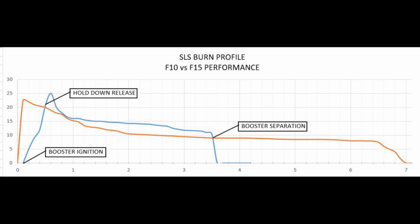To do this, you have to time everything correctly — all of that timing is really critical. You have to have the boosters triggered and the core triggered so that they don't overshadow each other. The core has to always underperform the booster for the booster to remain intact with the core. As soon as the core begins producing more thrust, it flies away from the boosters and they separate. The original way I intended this was just offsetting the hold-down time and then releasing, but in the end this didn't really prove to work out.